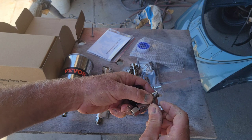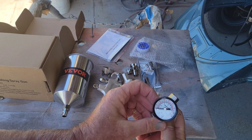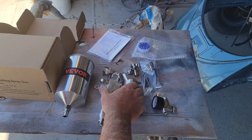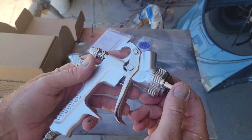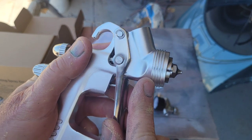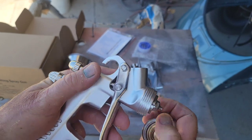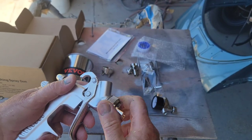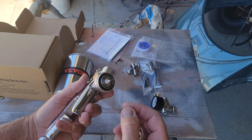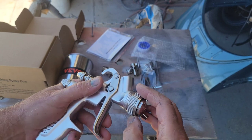First of all, this is what's in the package — we're not going to do an unboxing, that seems kind of silly. It does come with a pressure regulator, kind of a cheap one, but it feels like it would do the job. I buy the cheap ones typically anyway — it's readable, it works. The things I look for on spray guns: does it have coarse threads? This one definitely has nice coarse threads. The reason you want coarse threads is they're easier to keep clean.